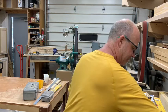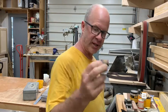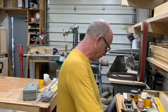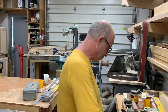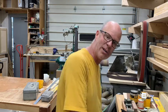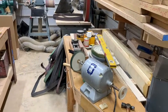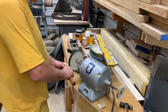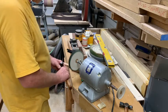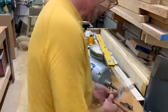I'm working these guys out on the buffer. What I've got is a cloth wheel — I have a clean one and I have some jeweler's rouge. I think this is fine, not extra fine. For my purposes with chisels and whatnot, it's perfectly fine. Also for polishing metal, Meguiar's rubbing compound is really great stuff. You can put a foam disc attachment on a drill and get stuff to a high polish with that. So I'm just finishing these up and we're not looking too bad — coming around the horn on this.